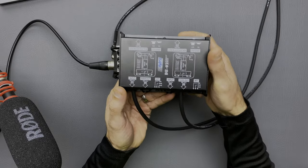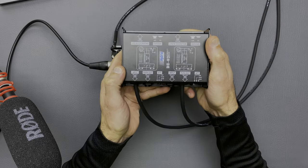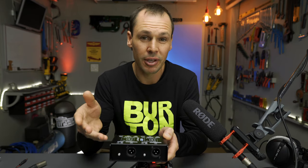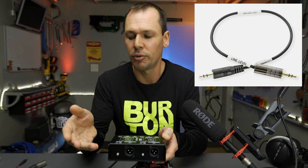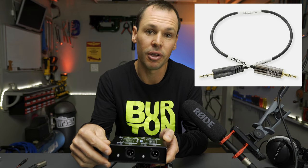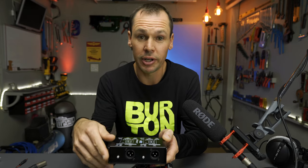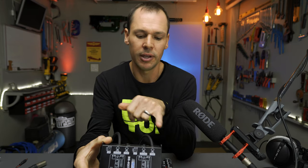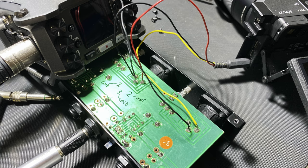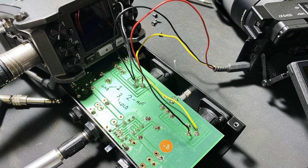So, as I said, the solution is through an attenuator box. The attenuator box I'm using is a Hybriddb-02. This is more of a stage box for plugging instruments into a mixer — something I had around. But this does the same thing as an attenuator cable you can buy: a male 3.5mm stereo jack to male 3.5mm stereo jack that plugs directly between your field recorder and your camera. I had this lying around so I just modified it — opened it up and soldered in some cabling.